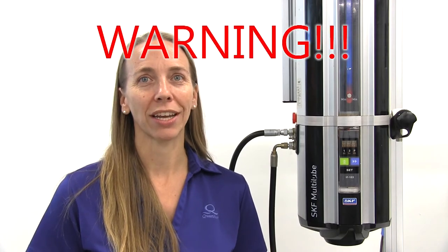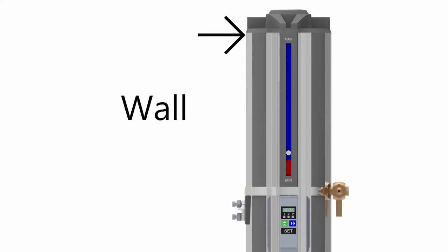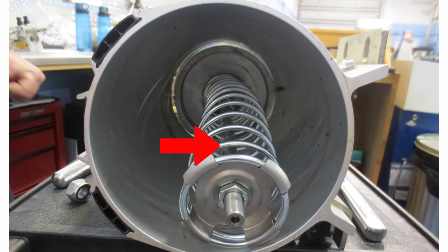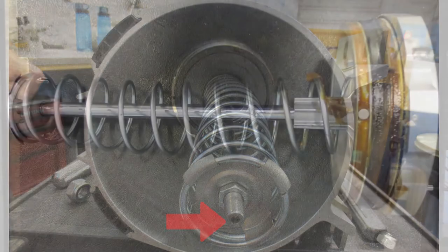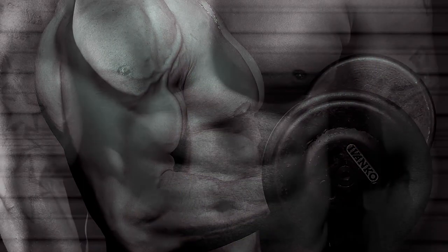If you need to troubleshoot the control unit, please take this as a warning: do not ever remove the screw from the top of the unit. The reservoir is composed of a lid, a wall, and a floor, which are held together by a screw onto a central shaft. The whole reservoir assembly is tensioned by a pretty strong spring. If you loosen that bolt, the lid, walls, and floor of the reservoir will separate and grease will go everywhere. Listen to a person who did it and then had to clean up the mess. Do not remove this screw unless the reservoir is completely empty and you have the unit on a workbench along with some seriously strong friends to help you put it back together again.